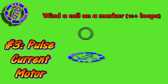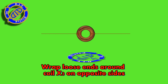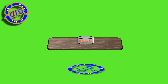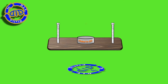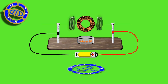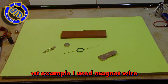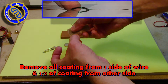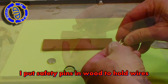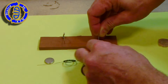Now we can move on to motor number three. We're going to create another coil, but this time we're going to make it more like a donut because we're going to wrap the wire on top of itself — about 10 times for this first one. Then take the loose ends on each side and wrap them in and around to help secure everything in place. As you can see in this graphic, we're going to create a platform to hang this coil over top of the magnet and then add our battery, which will cause the entire coil to rotate freely. For the first example, I'm going to use a little bit of magnet wire. Unlike the first two motors which had a constant flow of power, this time we're going to sand off the ends of the wire — except on one side, we're only going to sand off half of it, meaning one side of that piece of wire.